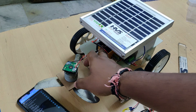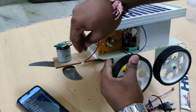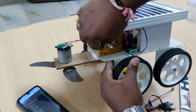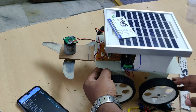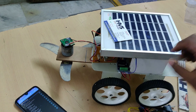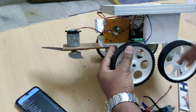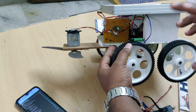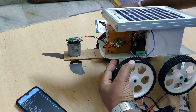The whole system gets its power supply from the 12 volt 1 amp battery, which is rechargeable through this charging circuit. There are two charging options marked T and S — to charge via solar panel, connect the S at the TRS slot. On the charging circuit we can see four diodes. These four diodes generally act as a bridge rectifier, but when connected to the solar panel they act as a polarity corrector.